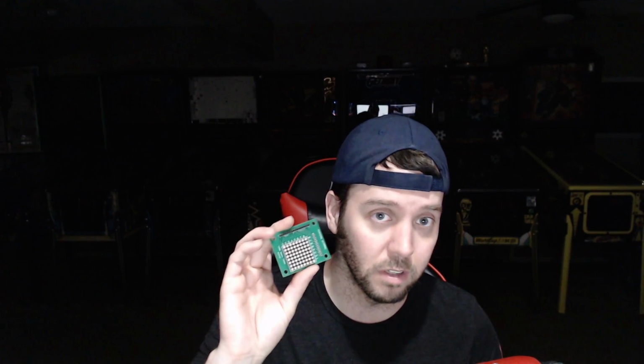Now I'm starting to do more content for you new people to the hobby out there, so this is something that I definitely recommend for you new guys, but it's also good for us veterans, because like I said, typically we would have to go through our lamp matrix test and use the whole playfield as judgment, whereas we could just focus on a little bitty board like this to determine what our lamp matrix problem is. And this also, like I said, negates 50% of your possible problems with your lamp matrix by negating the playfield. So there you would have it. If everything looks good on this board, but you're having issues with your playfield, then you know at least the problem is on your playfield and you don't have any board problems.